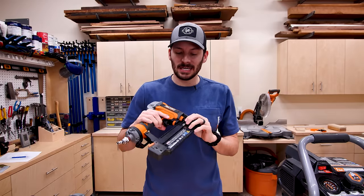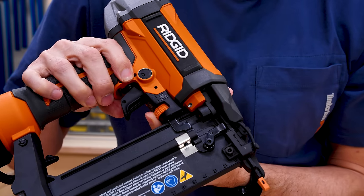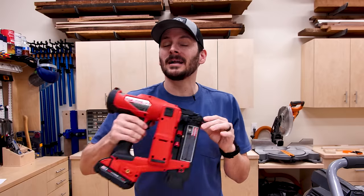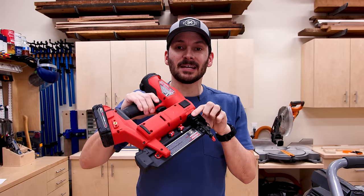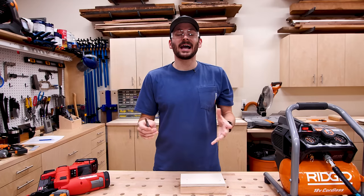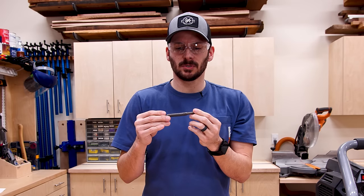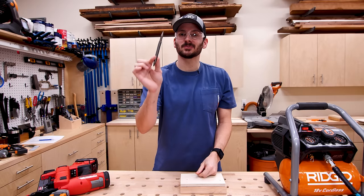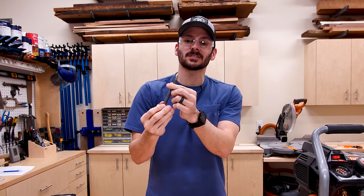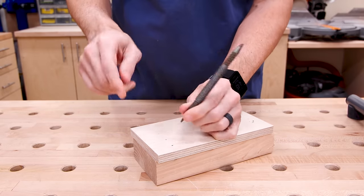The other way to control how deep the nails go is through the little adjustment on the nailer itself. Most of them have a knob you can turn that moves the driver up and down to help it drive further or shallower. If you have a cordless nailer, that's the only adjustment you have — there's a little wheel that moves the driver pin up and down to push it more or less. If your nailer doesn't have this adjustment, I'd highly recommend picking up a spring-loaded nail set. It's got a small end and a large end — you put it right on top of the nail you need to set, spring it into place, and it's done.